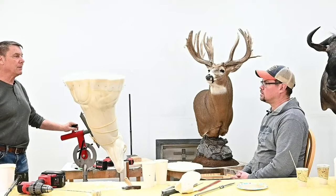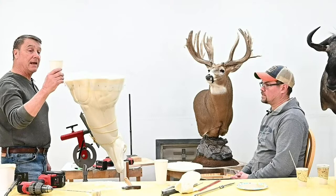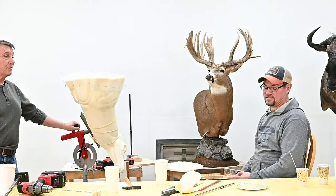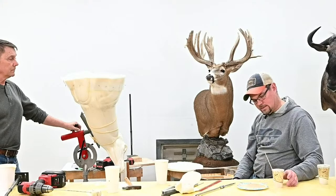Now, if I had to guess, I would say 3-pound foam will probably expand 4 times or 5 times the volume. So if I had this full of 3-pound foam, it would end up 4 to 5 times that when it's hardened. And for yours, I would say maybe 1.5 times. It's not a great foamer. You'll see I had about this much, and I can set that on there maybe 3 or 4 times to get about that high at the most.